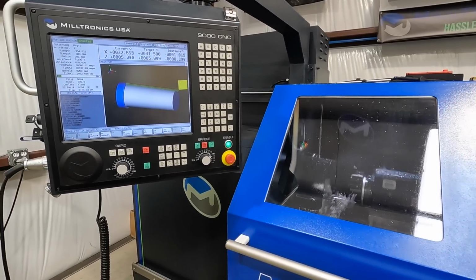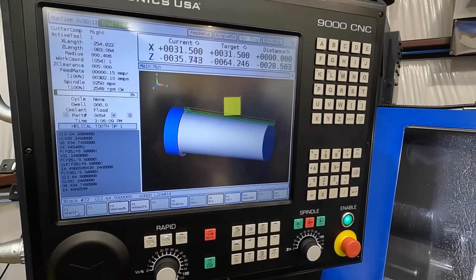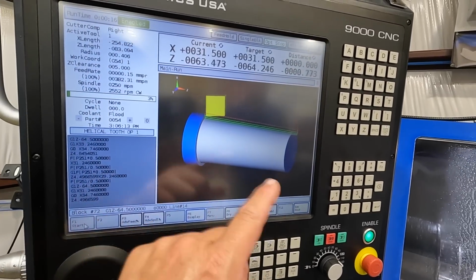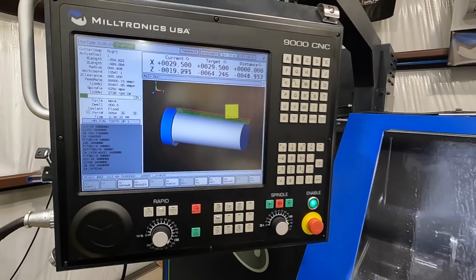And I'm really enjoying this. You've got a really good graphic up here that's showing the tool path every time, and it's very helpful on getting in there and checking and making sure that you're proving the system before you actually even make a cut. So the green lines are your cut lines, and the red is the rapid movements.